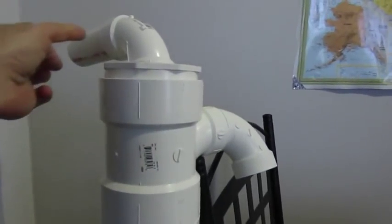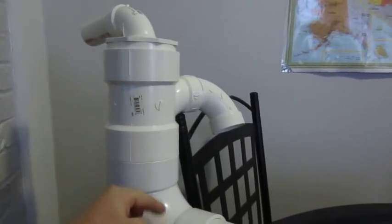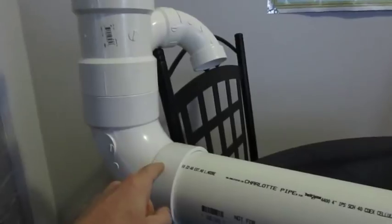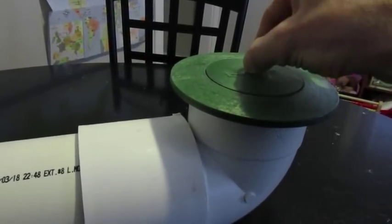Your pump pumps the water through here, down through here. It's going to go through this four-inch — you can use three-inch, but four-inch is a little more ideal. It's going to go down through here, and then typically what people do — this is all going to be underground — the easiest way is to use a pop-up diverter. These will lift up to let the water out, and then they'll close when it's done pumping.